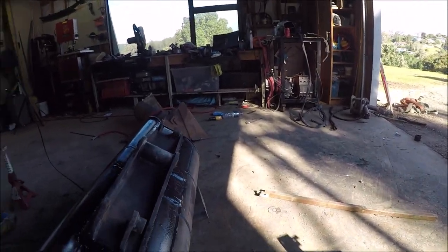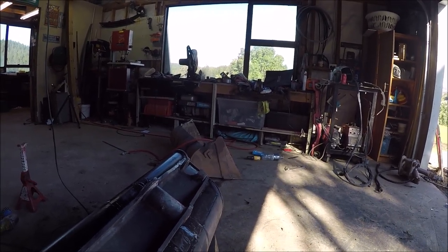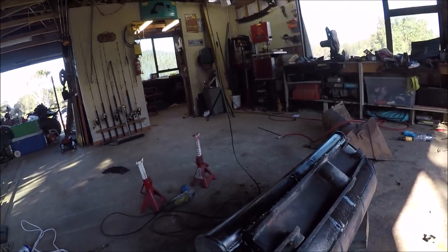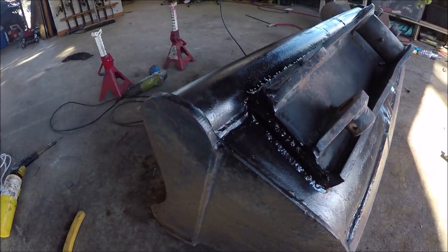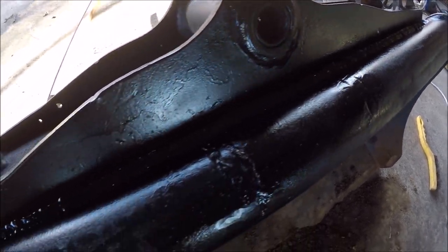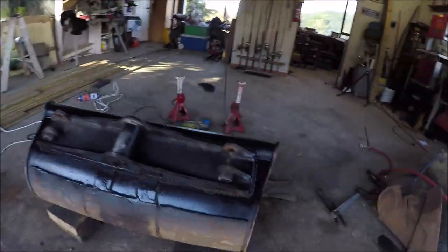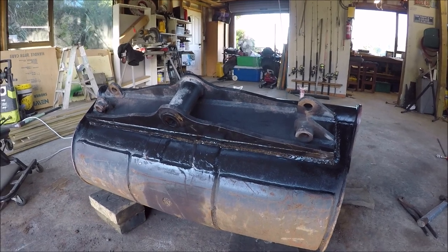Okay, that was a lot of welding for my little 160 amp inverter non-gas MIG. I could have done it with stick, but my stick's pretty old and it could be pretty wet. Sorry, a bit of weldy stuff up the nose. So there you go. Double welded all the way around. A few overloads and stuff. The trick to making welds look good is put enough paint on them, and they'll look magic. That's not going to go anywhere. That is well and truly attached to that bucket through and through. So it's pretty good.